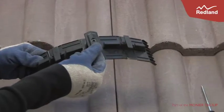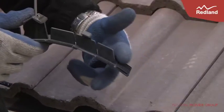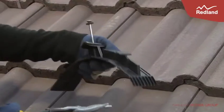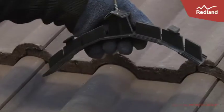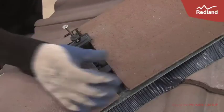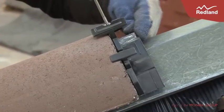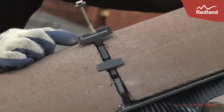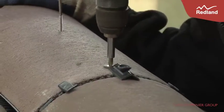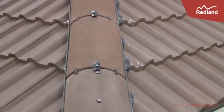Assemble the clamping plates, wood screw and flexi seal together. Depending on the profile, the flexi seal may need to be trimmed down to suit some hip tiles. Place a flexi seal assembly between each pair of adjacent hip tiles. Ensure that the hip tiles are butted up tight to the seal with the clamping plate on top of the hip tiles. The hip tiles should line up with the centre line of the hip batten. Screw the fixing screw into the centre of the hip batten until the washer will not turn between the fingers. Continue along the hip, ensuring the hip tiles and flexi seal assemblies are butted together tightly and screwed to the hip batten.